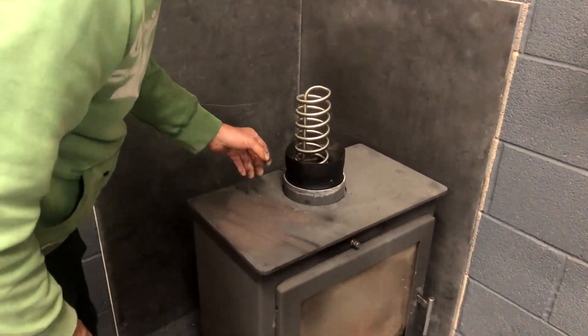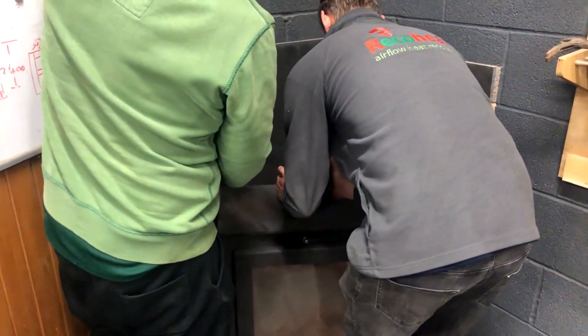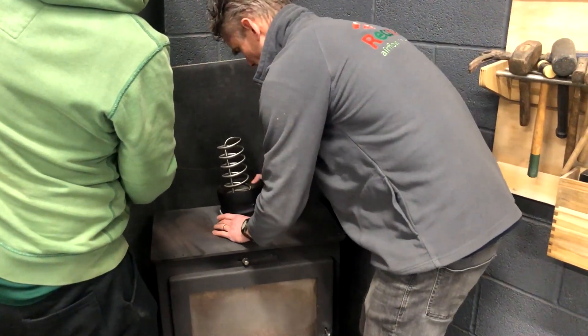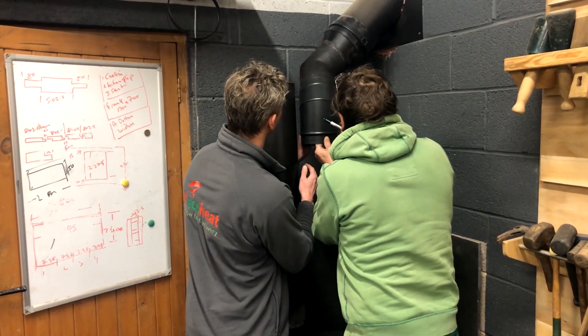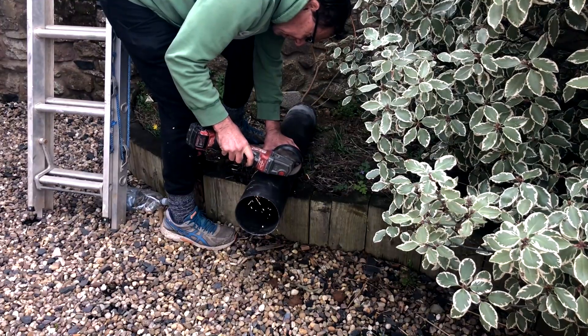We actually also moved the stove on Andy's installation to increase the convection flow around it. It's something like a 17 kilowatt and was warping the plate behind it because it was fitted so tightly. That meant fiddling with the angles, but once done Nick measured the section to be removed and cut it off with an angle grinder.